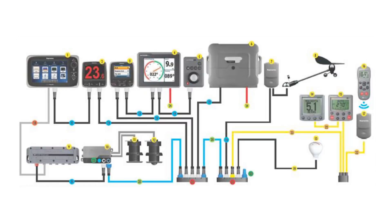So when you're actually tackling this project, the first thing I always recommend is you want to draw this out. Don't go about building your NMEA 2000 network simply from your mind and just tackle it, because what's going to happen is you're probably going to start creating these loops, these branches, and it's not going to go as well as you'd like. So the best thing is think about all the different devices that need to be on your NMEA 2000 network and draw them out at the bottom of a page.